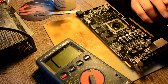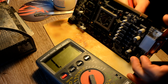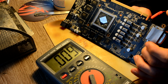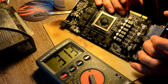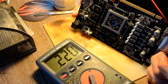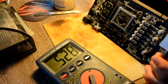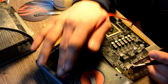I had a look at this graphics card and everything looks normal to me. We can go over it together. This is the resistance for the graphics chip — PCI Express — and we have one volt here. This is the PWM for memory, and we have one volt there as well. This is the memory itself — 1.5V — that's what we already measured. No shorts were found.